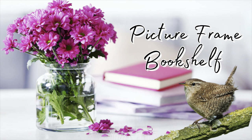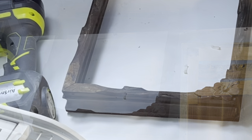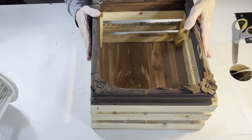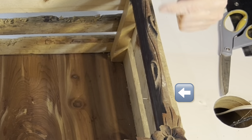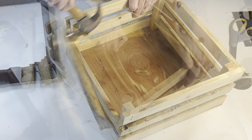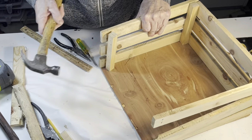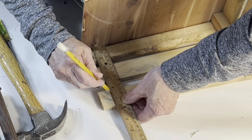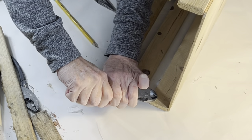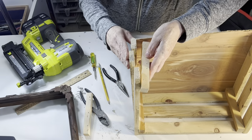This vintage frame is another thing I thrifted some time ago. One of the decorative flowers is missing, but I think it's still gorgeous. I had this crazy idea of adding the frame to a thrift store crate — it was almost the perfect size. The crate was just an inch or two too wide, but I thought I could cut it down. I removed the slats along one of the long sides and the two connecting wood corner braces, marked a line about an inch in on both the side slats and along the wood bottom, then used my jigsaw to cut along the line. But first I had to trim off the brad nails so my jigsaw wouldn't catch on them.